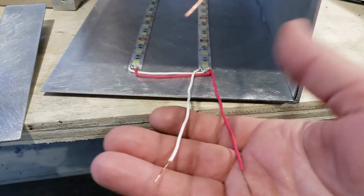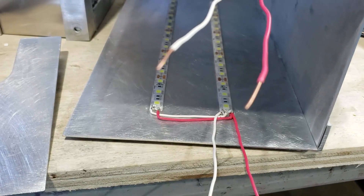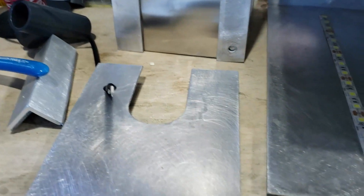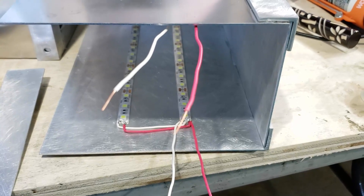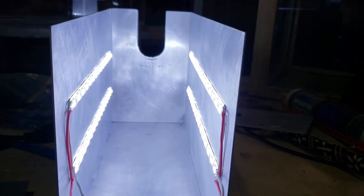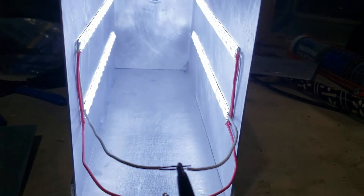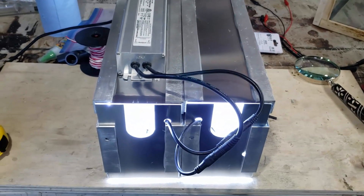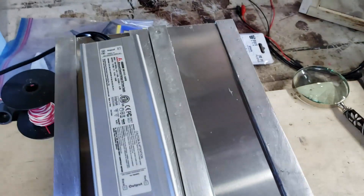The next step for this build was to interconnect all the individual LED strips. I soldered on some wires from each side — they'll be connected together and then go to this power cable, which leads to the power supply. I just drilled a hole in the side of the aluminum there so it feeds out nicely. I didn't show you the soldering because it's the same as the soldering from the other one. Every time I do a bit of soldering, I run a test to make sure they're working properly — I put some alligator clips on it to make sure I didn't break any connections. I can't show you the actual soldering because once I tilted this on end and put my hands in there to do the wiring, there was just no room to film — it was too tight.